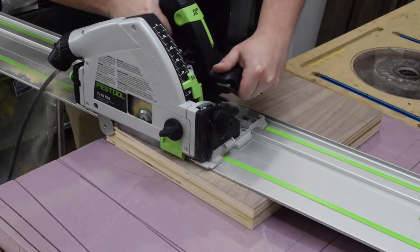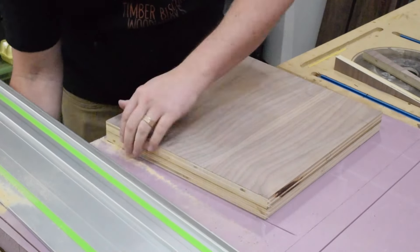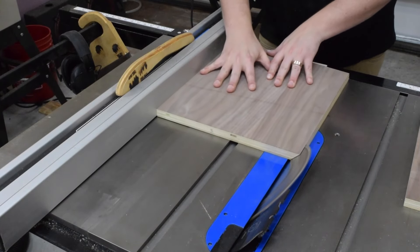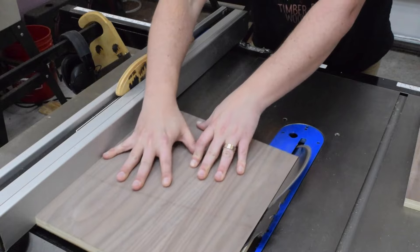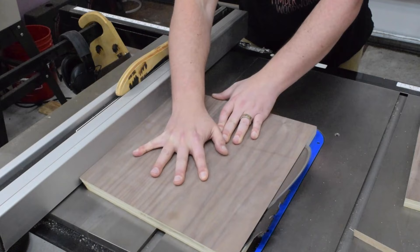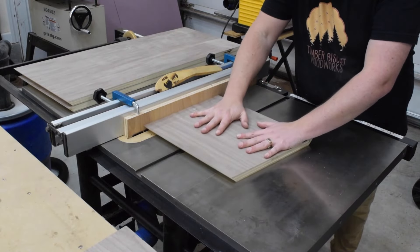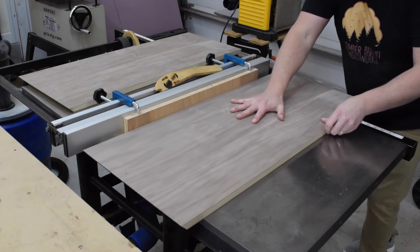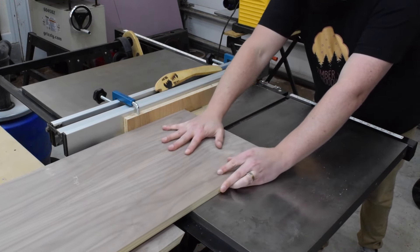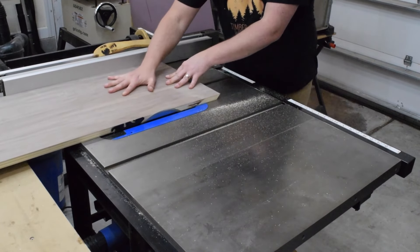I marked the 85-degree angle and cut both pieces using a track saw. To hold them together I used double-stick tape — just make sure you tape the pieces together so that they mirror one another. Over at the table saw, I cut the bevel for the top and bottom of the sides. Then I rabbeted the back of all the box pieces to accept a quarter-inch sheet of plywood. Since the front of the carcass is angled, I needed to cut an 85-degree bevel into the front face of the top and bottom pieces of the box.